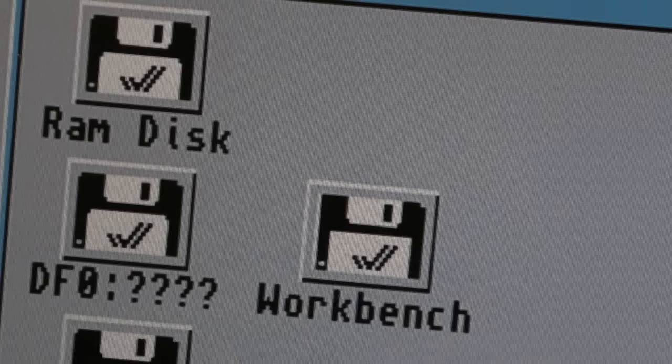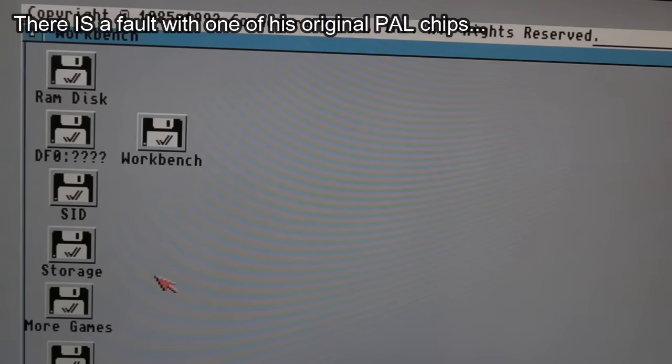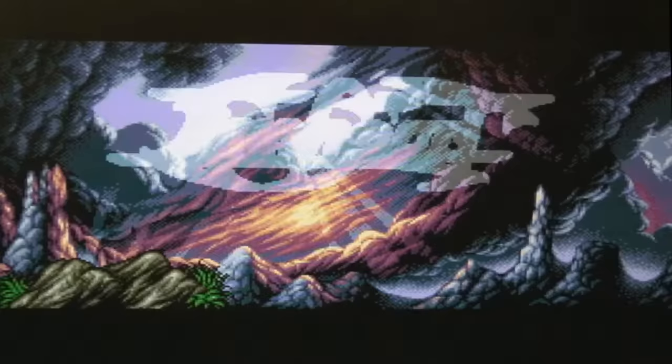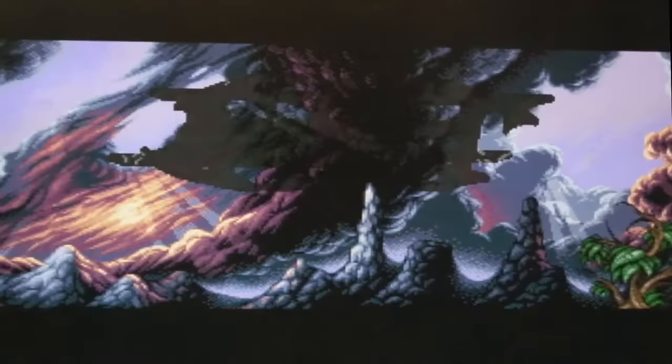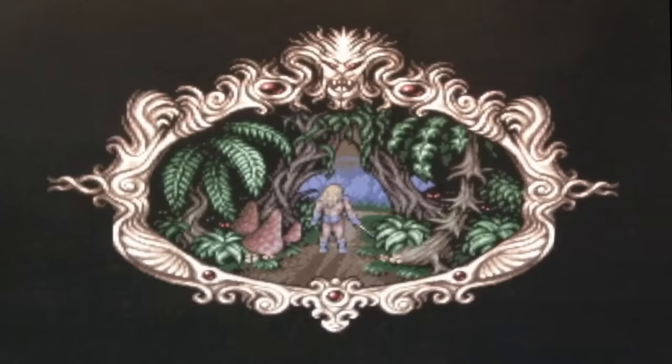Assuming the refresh rate isn't too much of a problem, it's crystal clear on the desktop as well. Worth noting I'm testing with NTSC chips but I'll put the PAL ones back on and test in a minute. The issues with this: I had to do a mod — a separate video — on the buffers for the video slot that got this super crystal clear. Also the fixes applied to the card — changing the trim cap, fixing that wire, re-soldering a few things, changing the cap on the PLL chip.